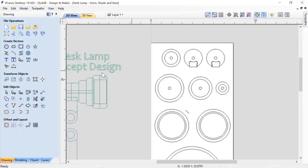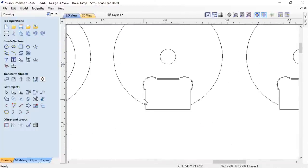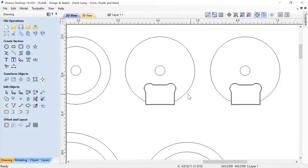These ones here are the rest of the shade. We've got the molding tool paths. We've got the holes for the actual dowel to fit in. And the only part that I didn't use an allowance for is this part right here, this insert. Now, the total combination of both thicknesses of these two circles, the material, was wider than the 1 1/4 inch arm that you're going to glue up into there, okay?